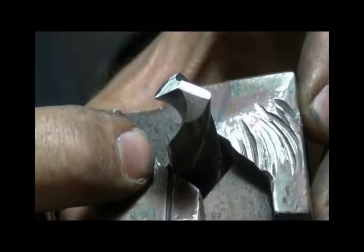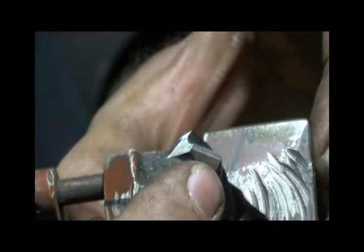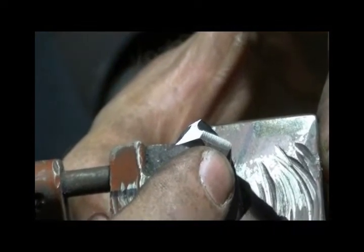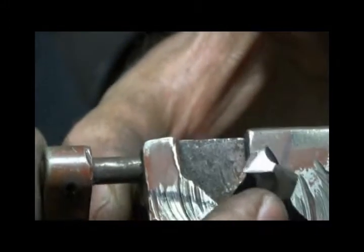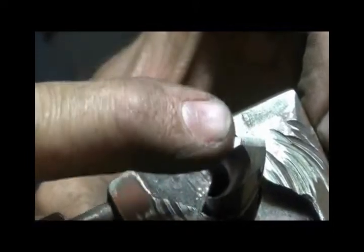Okay, I think you can see how that one is grinding. This bit is ground on the cutting edge and back about to where my finger's blocking it. The rest of this bit hasn't been ground. And now this side here, it's been ground all except for right in here. The whole bit on this side has been ground. So that one was really lopsided.